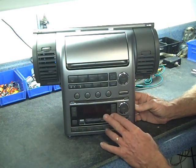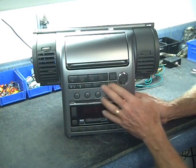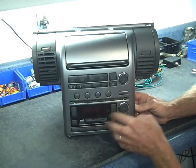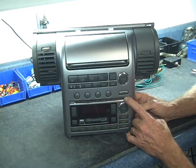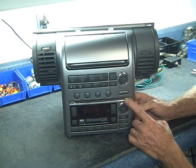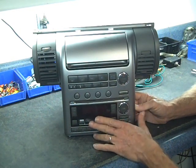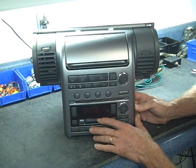One is no display on the stereo. Another is the AC controls cannot be changed or adjusted, along with the stereo controls not working — but you may find that the stereo can be adjusted from the steering wheel. We've also seen the CD changer have a problem; attempting to load or eject will give three beeps, meaning the mechanism is either broken or jammed. Sometimes we've seen the radio dead, and we've also seen a battery drain with this unit.